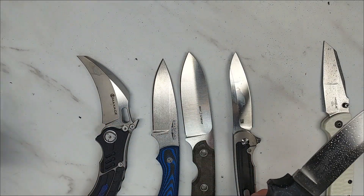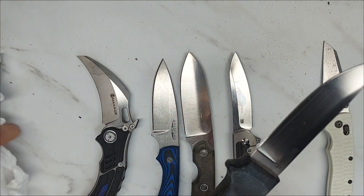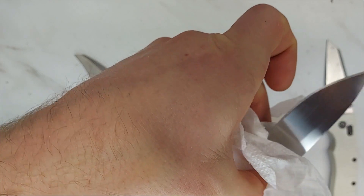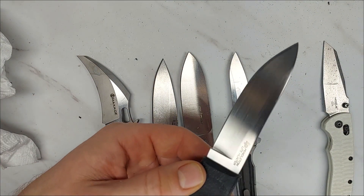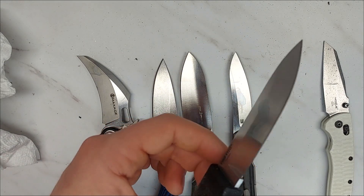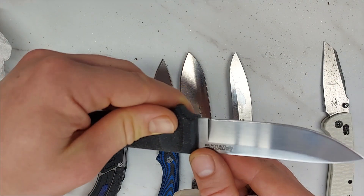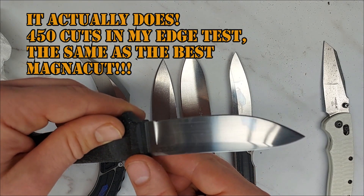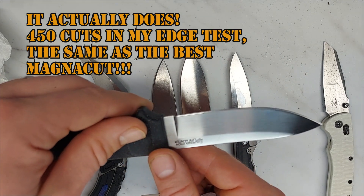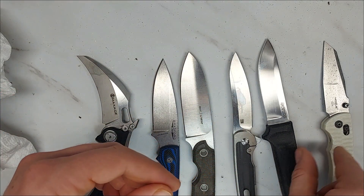This is the 4116 stainless steel — this is pretty good. There's really not anything to speak of; just a little bit of surface stuff visible before I wipe off the salt. This is more like a kitchen cutlery steel, so you would expect better corrosion resistance. It doesn't have the edge retention of some of the others, and I will do a test on that, but really excellent corrosion resistance.